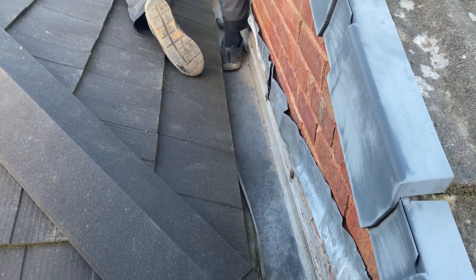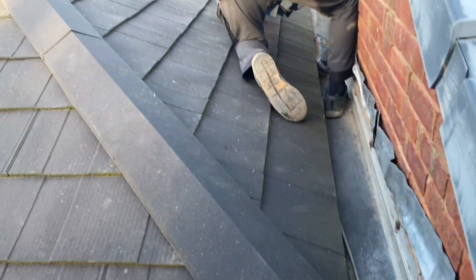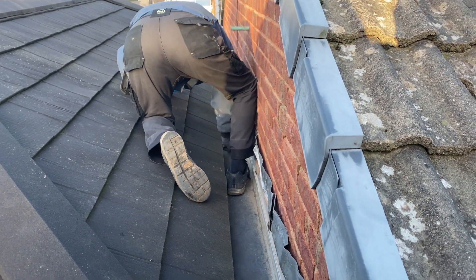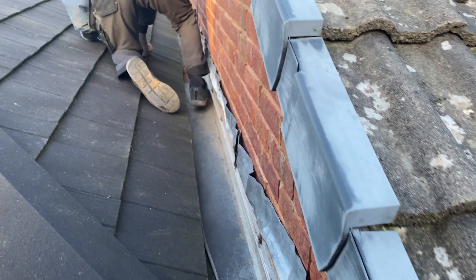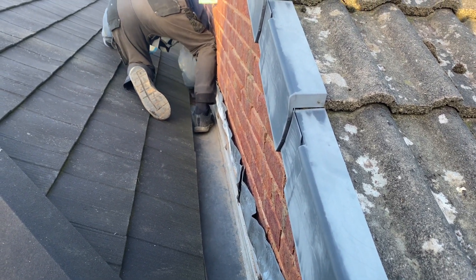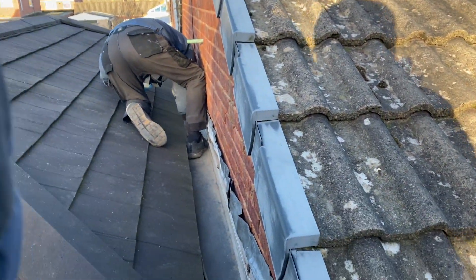Right, so that's the box gutter. As you can see, the house wall, it's a conservatory roof and the leak's just in front of Grandad, but everything seems to be in order. The lead's got a couple of splits in it, but it's not as if they're gonna do any damage, so not too serious just yet.